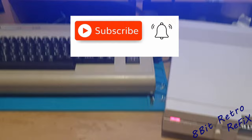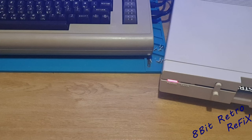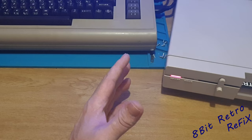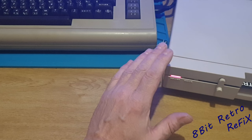Right, so what I've done is I've loaded Ghostbusters up — this is just standard as you can see on the screen. It's just a normal Commodore BASIC and in the 1571 disc drive there is just a standard kernel ROM. So I'm going to pull out the standard kernel ROM, put JiffyDOS in, and then do a speed test to see how long it takes to load Ghostbusters under JiffyDOS. I've just run it now so I've got the figures and I'll put that up on screen after we've done it so you can see the comparison.